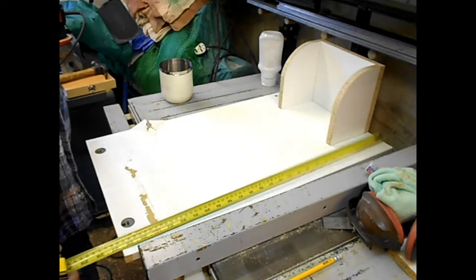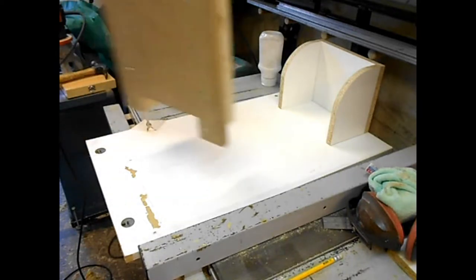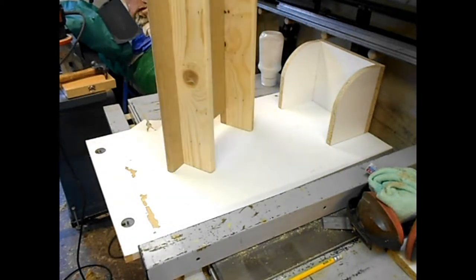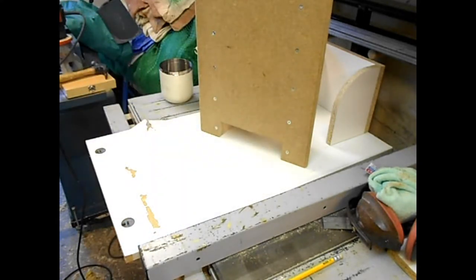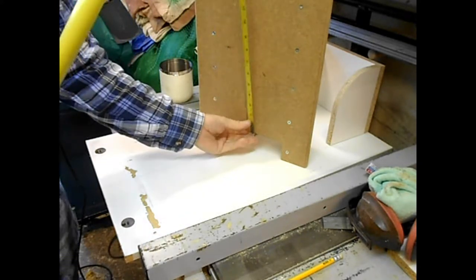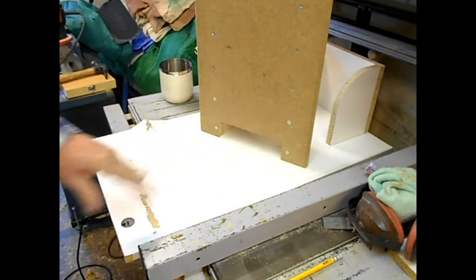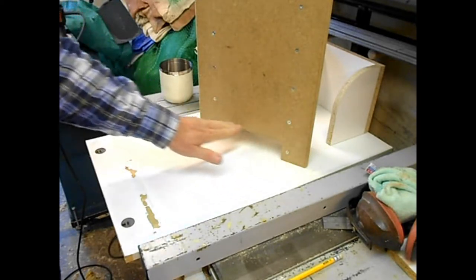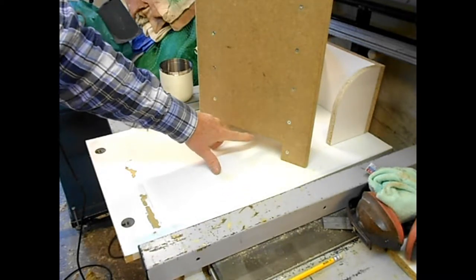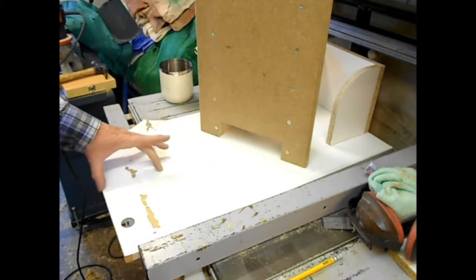Use the full length of this, 26.5 inches. The piece that goes on the back from here, which is effectively the cutting surface, to the top is 28. So if I'm going to be swinging this router bit backwards and forwards, the router bit will extend down below the base of this, probably anything up to half an inch, I'm going to say.